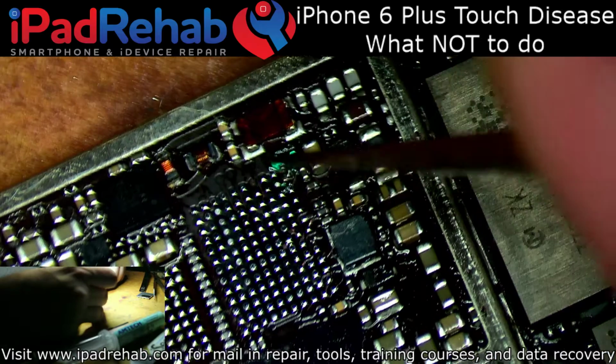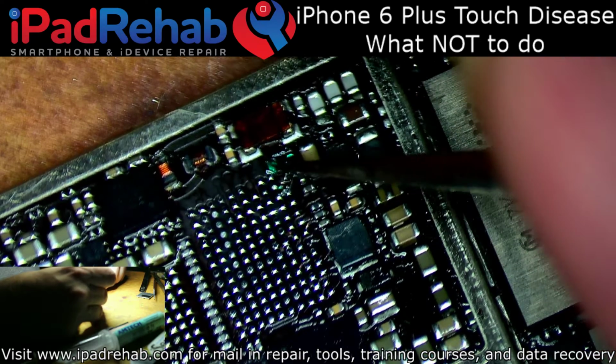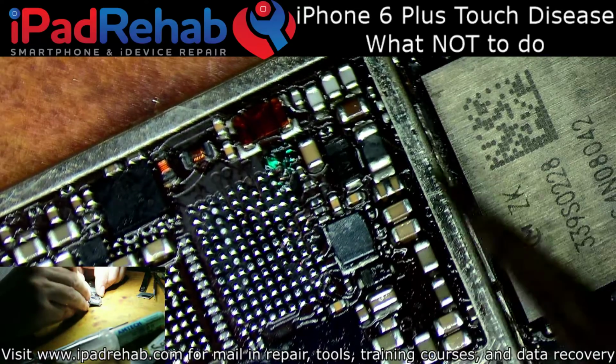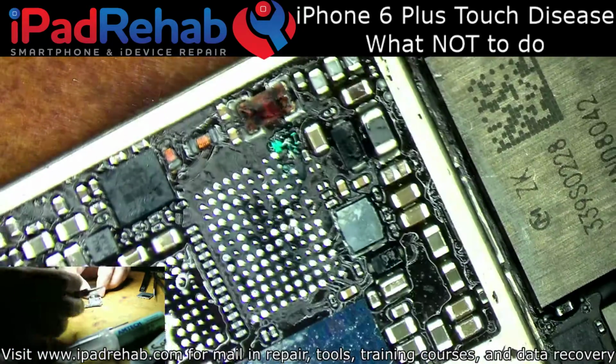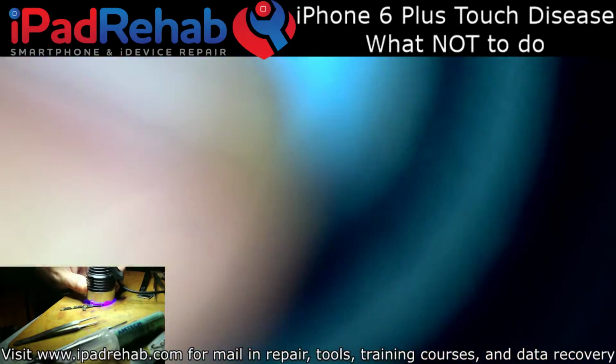Now, you may be looking at this and thinking, oh, there's clearly a missing ground pad there, and the last person to work on it knew what they were doing because they exposed some of that ground so that ball could attach to it. My answer to that would be all four corners of this chip are ground, as are multiple other pads throughout the array. Losing that one corner ground pad is not going to hurt this at all, and it's much better to just leave it off. If it comes off, leave it off, and let the other ground pads do the same job. No need to create the possibility of your jumper shifting and touching that ground in the corner because you're trying to make a jumper or whatever. All right.